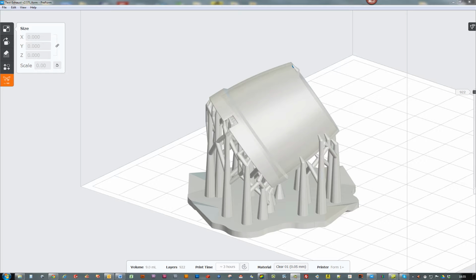In your reply, you talk about the riverbed type separation of the base. Yes, I had experienced that, and the support team at Formlabs had asked me to reduce my bed height by 0.5 millimeters, which really helped, and I haven't had any issues since then. That print with that showing on it must have been done before I changed the fine-tuned settings in PreForm. So that's definitely resolved.